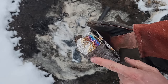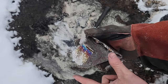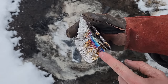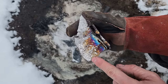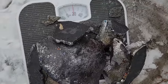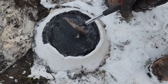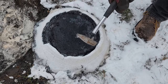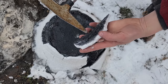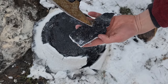Basically I have a big chunk of impure iron. The plastic and paint from the cans — my guess is it incorporated a lot of hydrogen into the metal, and hydrogen causes brittleness. That's why it broke. The slow cooling also caused the large crystals. It's very pretty though — look at that rainbow coloration and thin oxide films. Let's see what the iron yield was. That's just under 20 pounds of iron. Let's have a look at this slag. First of all, we've got the sand.